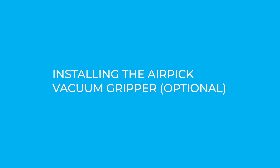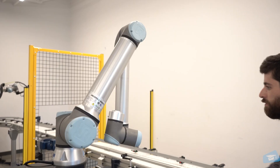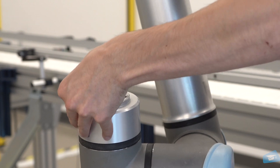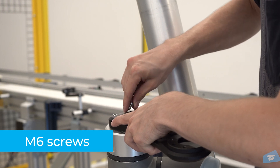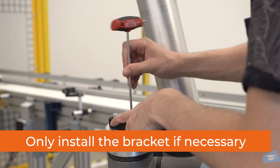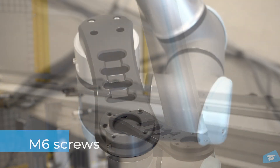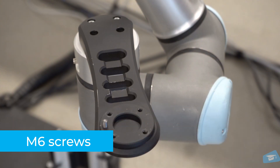Installing the Airpik vacuum gripper. Now we can install the Airpik vacuum gripper, its accessories, and the cable routing system. First, power on the robot and rotate the joints as described in the table below. Once that is done, shut down the robot. If more reach is needed, install the extra reach gripper bracket on the robot tool flange using four M6 screws and tooth lock washers, and align it with a dowel pin. Important: only install the bracket if necessary — consult the configurator to find out if it is needed. Using four M6 screws and tooth lock washers, secure the coupling on the robot tool flange or on the extra reach gripper bracket.